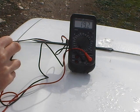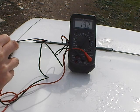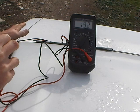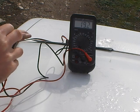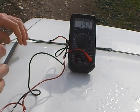You often get 18.5 to 19 volts with most panels. It's supposed to be 21.24 at a maximum. There's plus or minus 3% tolerance. And you've got to remember some of these figures are slightly sort of dreamed-up Chinese figures. Some of the plastic wrap is laying over the solar panel again, which isn't helping things.